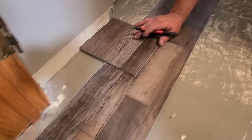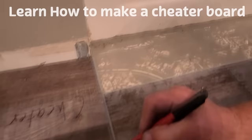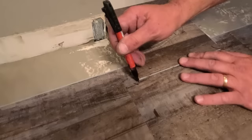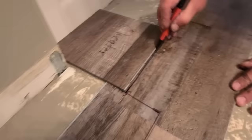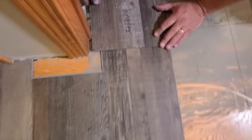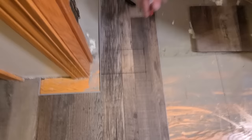That's cutting out around the jamb. Now I'm going to do the same thing down here — come down to the corner, bring this out a little bit — I can see it's kind of at an angle. I'll show you another thing you can do here. I know where the corner is right there. If I come up here and get it butt tight there and bring it over a little bit so I have the gap, I'll make a mark right here. I can use this board as a guide and now I have the angle to that. I'll just keep going down the bathtub with my cheater board. I'm only leaving an eighth-inch gap. I still need to mark this side of the jamb — line up my cheater board on the side of the jamb so I have that quarter inch, make a mark, and square up the cheater board to make a nice straight line. Now you can see how that's all marked.